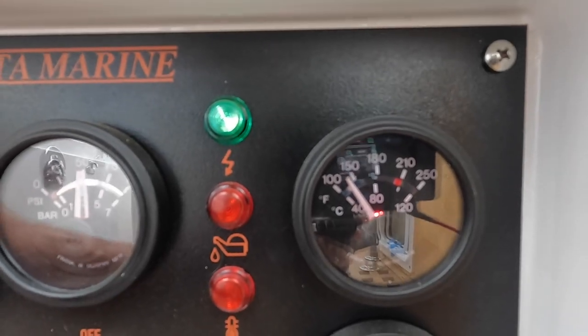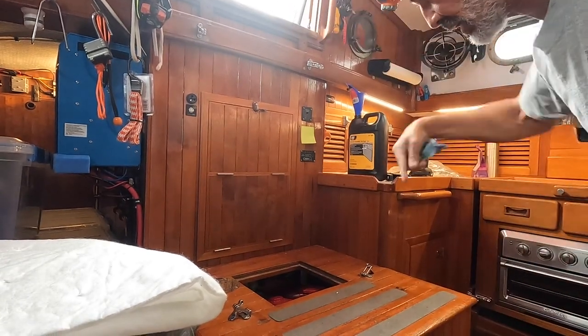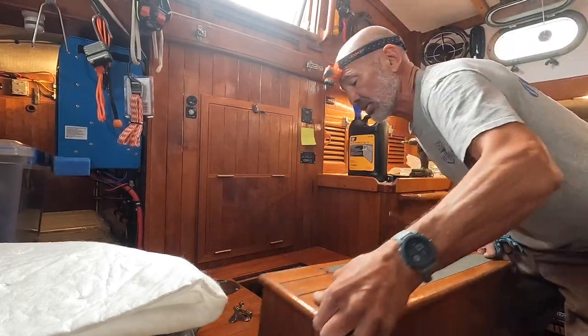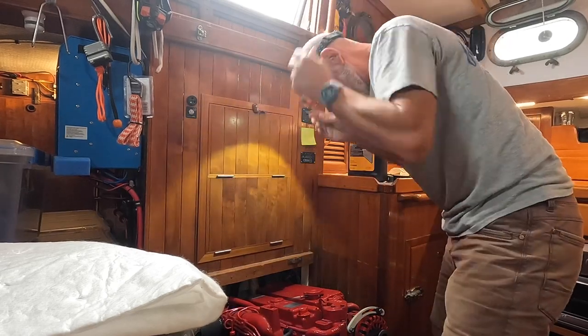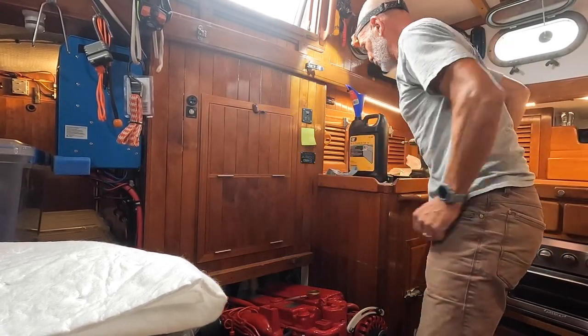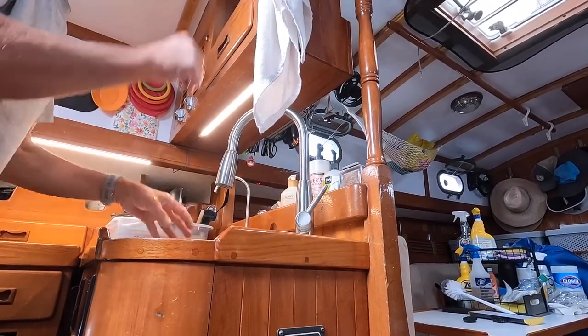It's been quite — about 140. Topped it up quite a bit after starting it. There's a little bleeder in the thermostat and I'll check it again once the thermostat tries flowing — I want to keep it open around 150. Coolant appears to be circulating through the heat exchanger. That's 15 minutes circulating through and the temperature hasn't gone above 160 — sitting there nice and steady. I'm going to carefully open this up because it's probably hot and under pressure. Everything's dry, all my connections, no leaks. Coolant is circulating through. We are not overheating. I can feel the water starting to warm up.